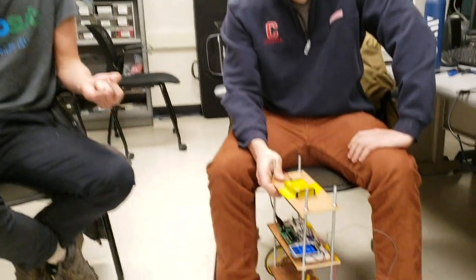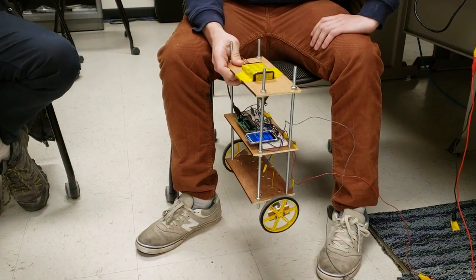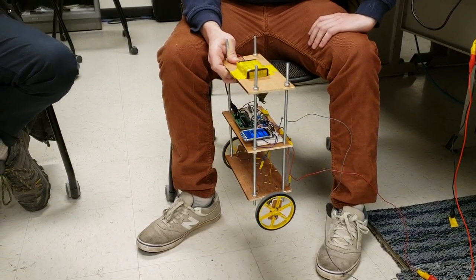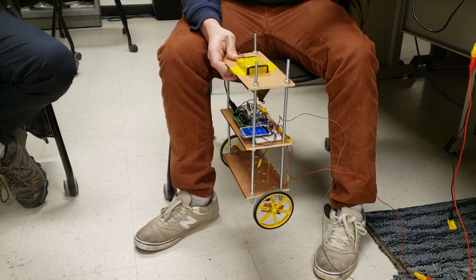That also meant we spent quite a bit of time trying to find the balance point. That's tough to do because every time we pick it up, or it falls over, or we come back the next morning, the IMU has shifted slightly, and that really affects things. So we have the balance point and P and I terms all connected to potentiometers that we can very easily access and modify — it really made our lives easier. So you don't have to reprogram to change the PID or to affect where the vertical position was. Right, exactly.